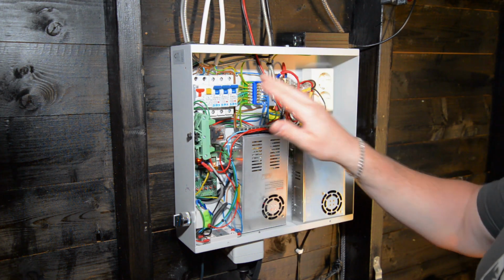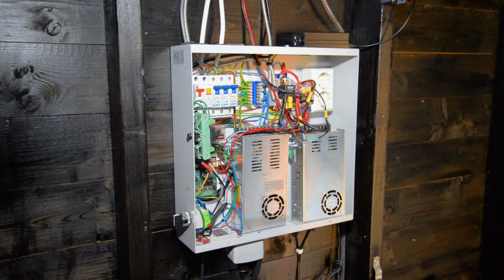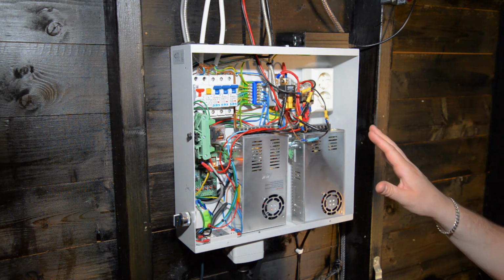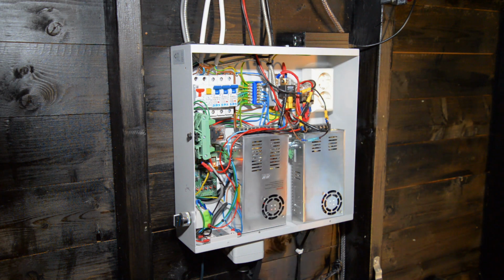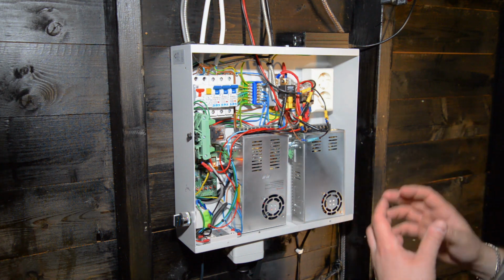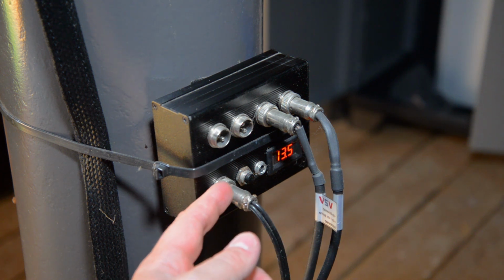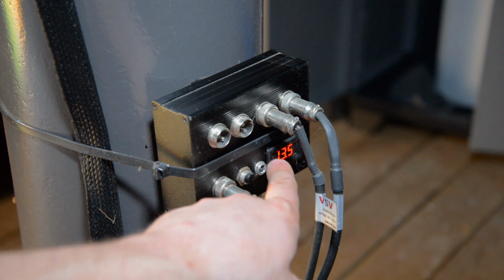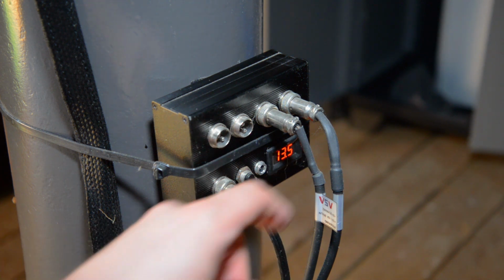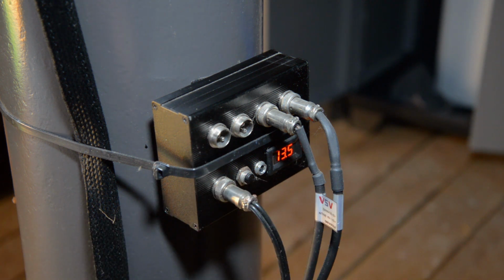So I'm going to turn on the power on all of these outputs, so it powers my computer, my security cams, this outlet here where I have a fan blowing air inside the observatory, so I get a slight overpressure to keep the dust out. The power from the power supply unit is coming inside this box here. I have a regular 5.5mm output here to output some power. I also have a fuse, automatic fuse. I have to check the amperage of that one because I don't know the rating on it right now.